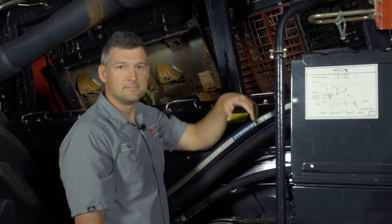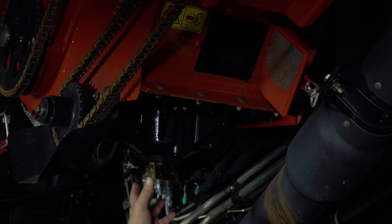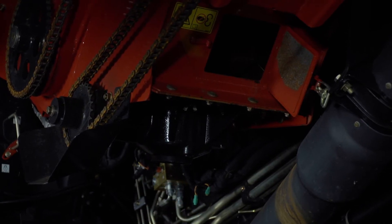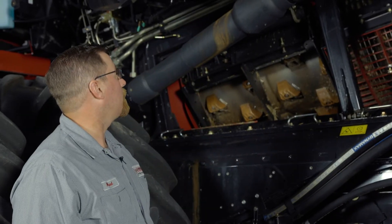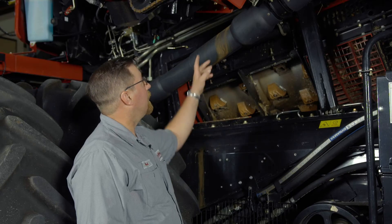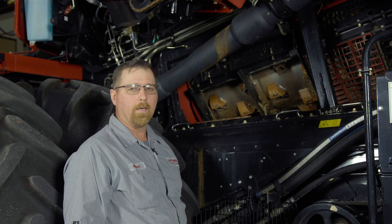Once we're in this area, we want to make sure to come over here to our rotor shift lever and give it a couple of shifts to make sure that linkage stays free and clear. While we're in this region of the combine, we're going to talk about the unloading auger drive and the lower vertical gear case. The lower vertical gear case has a sight glass on the back side of the housing. We want to check that to make sure it's filled with the proper level of oil, but also it's a good place for moisture to enter. Sitting inside the vertical auger cavity, we want to make sure that oil is not milky — and if it is, it's definitely time to flush and change that oil.